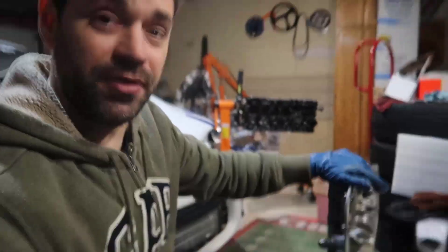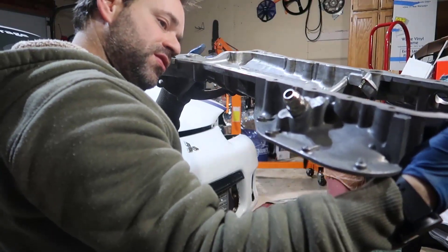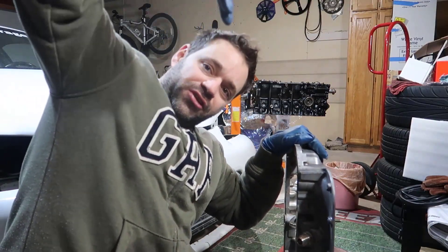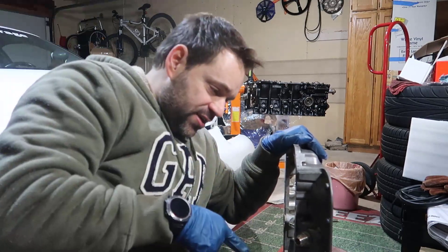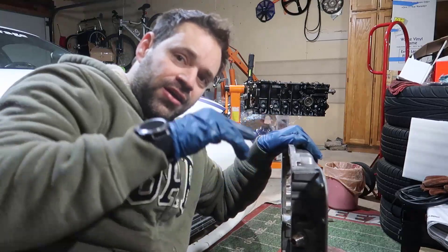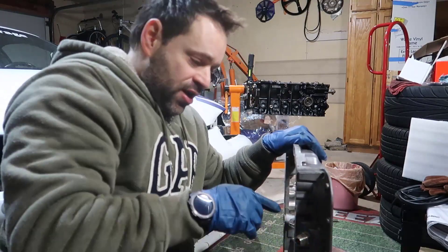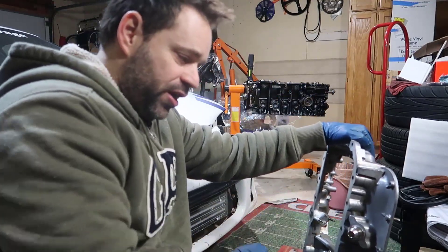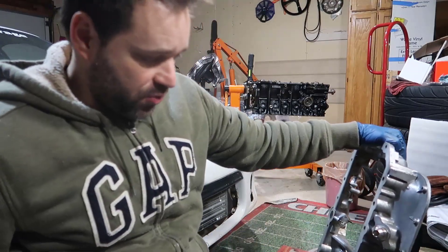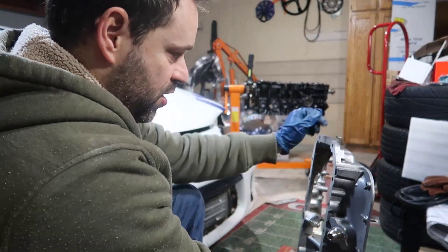So I just want to say one thing you need to be aware of: pay attention that this goes like this, and this step has got to be — let's say 45 degrees or even zero degrees, not 90 degrees horizontal like this. Because this doesn't have pressure when oil comes back to the pan, so if there's something going like a balloon that goes down and up again, that's gonna have oil stay in there when you turn off the car. You don't want that — you want all the oil to drip straight in there. Toyota thankfully has this little spot that's made for it, which is for the turbo. So we just use that spot, but in case you're trying to do it on the pan or somewhere else, just be aware you can't do it horizontal — you need to do 45 degrees or straight down. That was pretty easy, pretty simple.